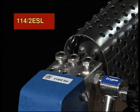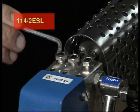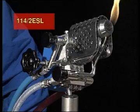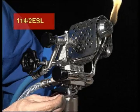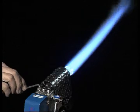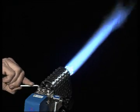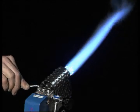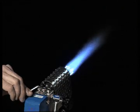On the top side are the adjusting screws for regulating the oxygen flow for the pinpoint flame, the medium flame and the intense flame. Underneath are the valve screws for controlling the gas flow for the pinpoint flame, the medium flame and the intense flame. Turning the valve screw clockwise reduces the oxygen flow. The lack of oxygen causes a bright gas core. Turning the valve screw anti-clockwise generates a surplus of oxygen, which causes flame turbulence and cold areas.